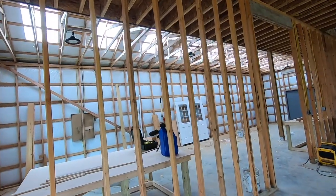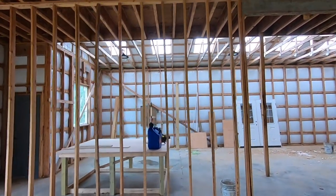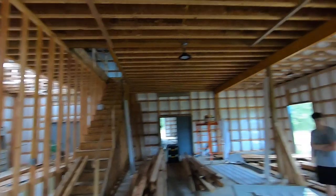So we're going to get after it — I'll measure, cut, and get ready. As you now know, these are 16 inches on center. The exterior walls are two feet on center, but since this is holding weight we put these on 16. All your sheet goods — 16 inches on center works great for four-foot and eight-foot material. With a four-by-eight piece we shouldn't have to rip anything for it to break perfectly on the studs. We're going to get the majority of this done today.